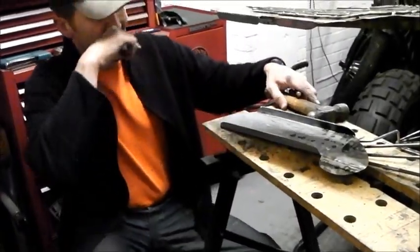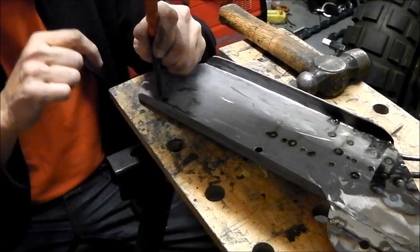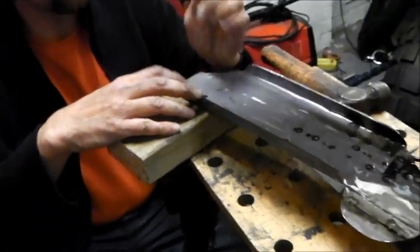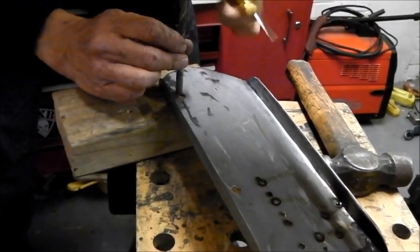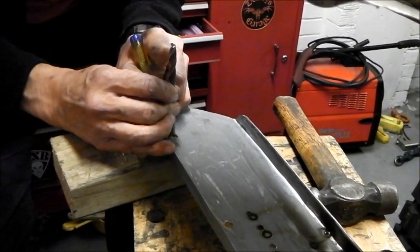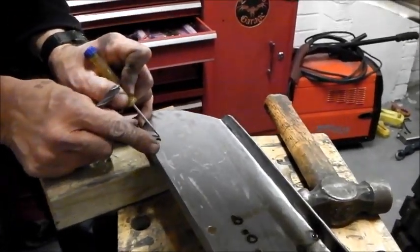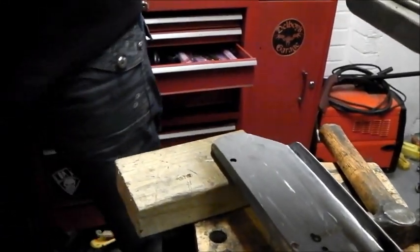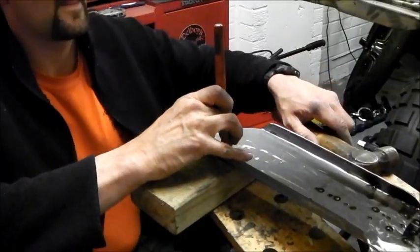All I need to do to make a slot is drill another hole the same size as the existing hole, as close as possible, and then just use a round file and go between them. An 8mm drill, coming as close to that hole as possible without encroaching into it — that way when the drill goes through it won't bias itself. To find the center punch mark: make a square box around the drill position, cut corner to corner both ways, and where they cross is your center punch — exactly in the middle.